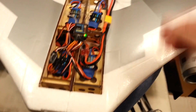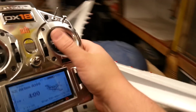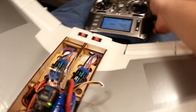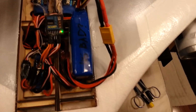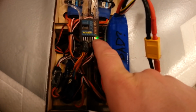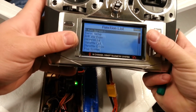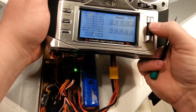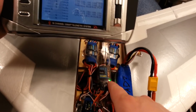Okay. So since they're moving, that's always promising. And because these are moving, looks like we're going the right way. We also need to turn flaperon support on, which means that the stabilizer, when activated, which incidentally is not on because, see how this light is green and red? We're not within the range. So we would have to go to servo setup, and I want to change my range to 150 and 150. Okay, so we're on the wrong side of things.